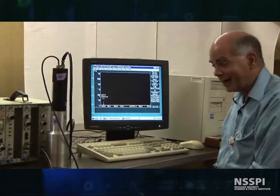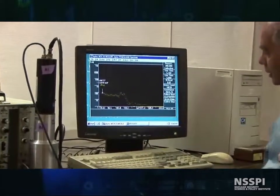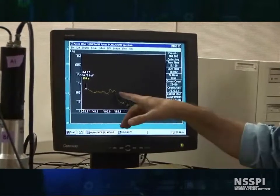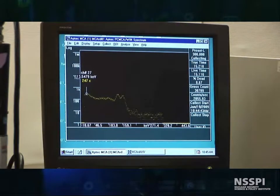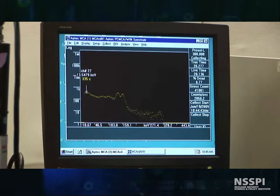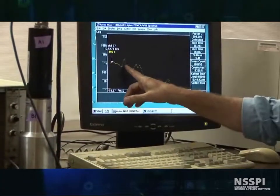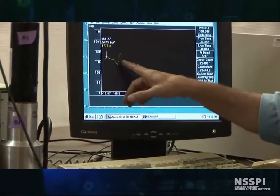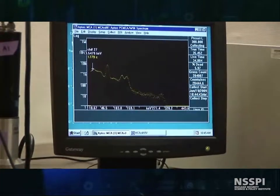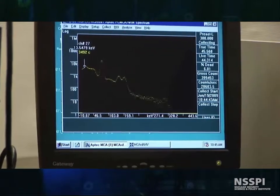It's going to scan for a second, and it will now come up. There's cobalt-60. So this is 1.3 MeV and 1.17 MeV, and you can watch them grow in. There are two points if I wanted to do an energy calibration. Here I have cesium-137, so let's add it near here — and there's cesium-137. Now I could find the channel, the centroid of each of these peaks, and I could do a crude, or even fairly good, energy calibration.